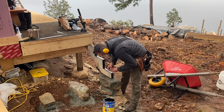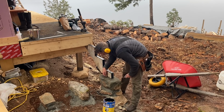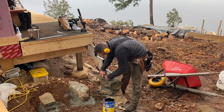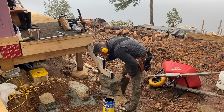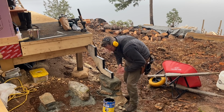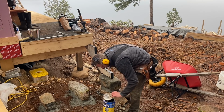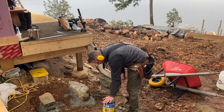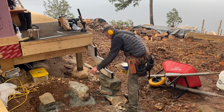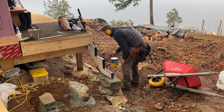It also leaves about a 1/2 inch air gap underneath your stringer, so rain and everything that's going to pour down on these stairs will be able to drain off, and air will be able to get underneath there and dry out any moisture, right? So it's going to keep your stairs from decaying, add more life to your project, right? So I'm going to do that on the other 2 stringers, or the other 2 rocks, because they're a bit lower.